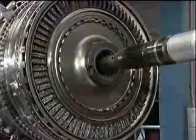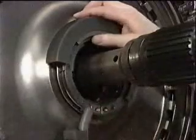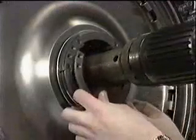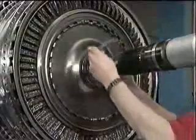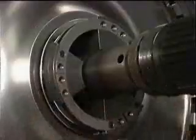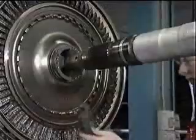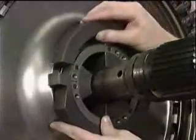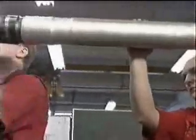The guide bar has a smaller diameter than the LP turbine shaft and it will have to be supported. So remove the spacer ring halves, assemble and fit sleeves C inside sleeves A, and refit the locking collar. Now the module can be separated from the guide bar.